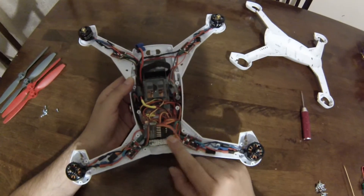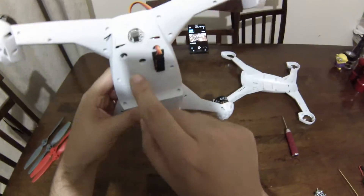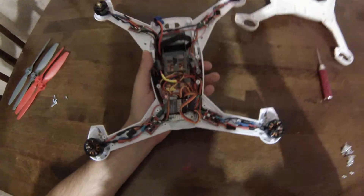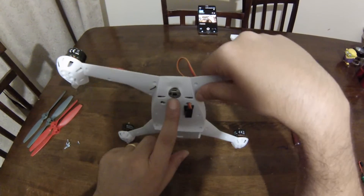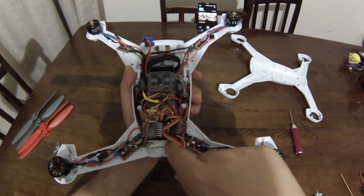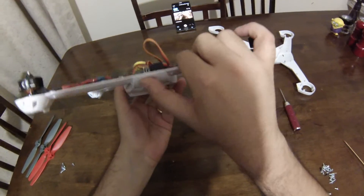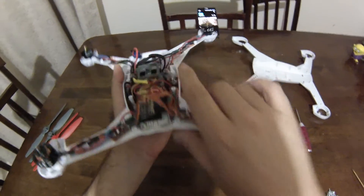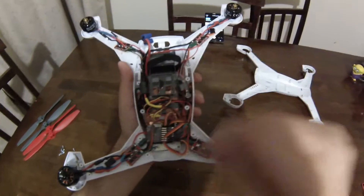There are usually three or four standoffs here where you could screw your gimbal. I snipped those down and leveled them. After that I used a Lexan body reamer to make this hole, and then I stabilized the board using Bondic. I heated that portion with a heat gun and just pushed the plastic — it's very soft under heat, softer than I thought. So now I have full access to it to tune or change anything.